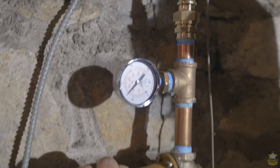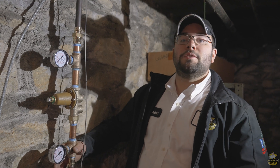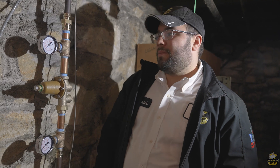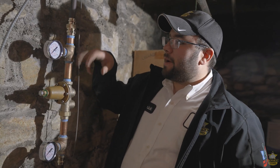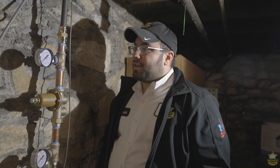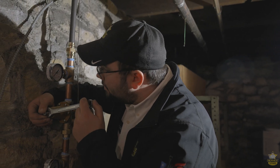We're going to stay right at 70 — right where you want to be. During the day you're going to see a lower pressure because everyone's using water, but at night you're going to see that pressure climb. This could easily get up to 100, 120 psi — I've been in other towns where it was 125 in the middle of the night and it blew the relief valve on the water heater because the expansion tank went bad. The PRV restricts that — now it's only going to be 70 pounds going out. It's got basically a check valve built into it, which is why we need that thermal expansion tank now, because the water pressure can't push back through here. Now you can see on both gauges what the pressure is going to be, so we're going to lock the retaining nut back down so that it doesn't adjust.